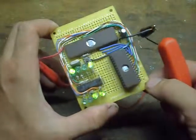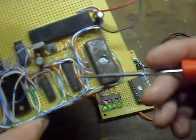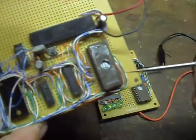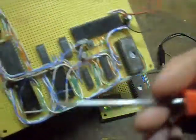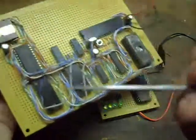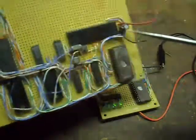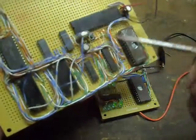The 8048, the 8049, or the 8051s, on the other hand, require an address latch to demultiplex the high and low order bits of the address. But you get the usability of a full data bus, which lets you hook up normal Intel-compatible peripherals and obtain standard processor-like functionality.